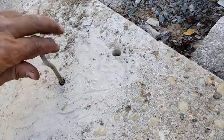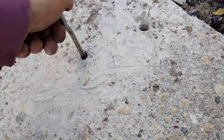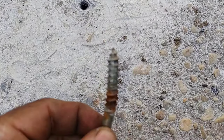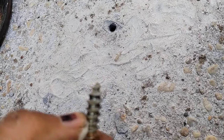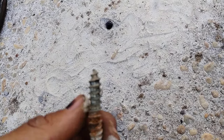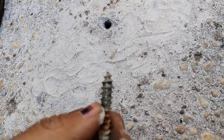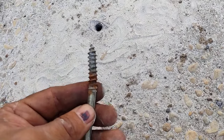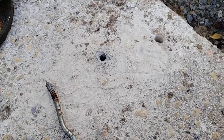Let's take a look at the screw. I thought I could get it out. Let's see what it looks like — how much lead might be inside the screw itself. I don't see any lead, just a little shiny spots there. Looks like it engaged one, two, three, four roots. Pretty good. You can change the thread pitch to help you, but this is pretty much the pitch that works for these anchors. Hopefully this video was helpful to you.